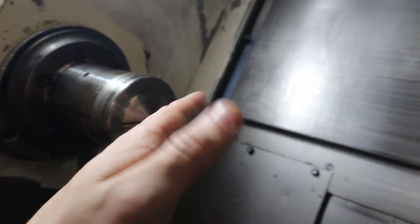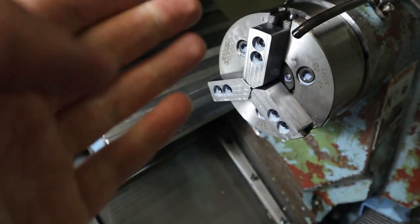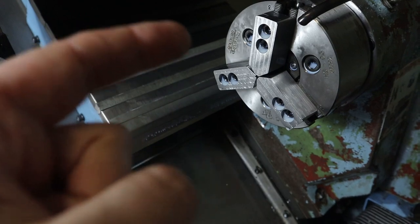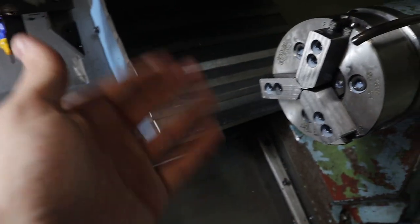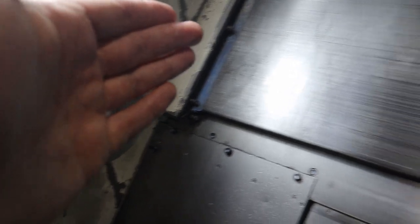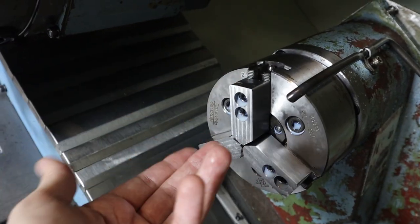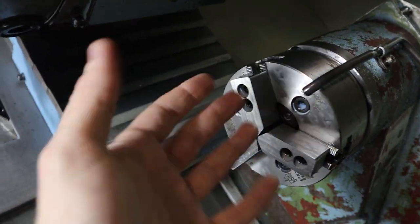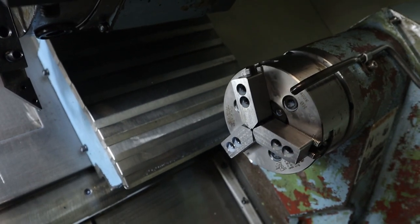The stop pins, I've done the same thing. I had to make smaller subspindle jaws, but those work really good. So I'm hoping we can figure out how to do this on here. Basically, what needs to happen is we need to orientate the subspindle to an orientation of 0 or 5 degrees, figure out where that ends, and then we need to align the main spindle so that C0 is in line with B-axis 0. There is no rotational code for this thing, it's just not an M code, but basically whatever this is at 0, then the main needs to be in line for the square transfer. So I'm going to figure out how to do that, and then we'll continue on.